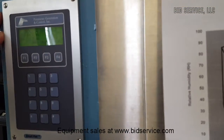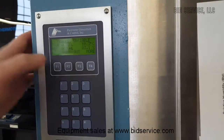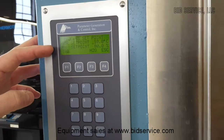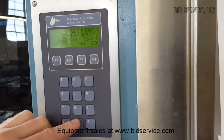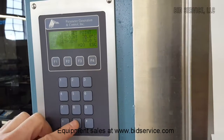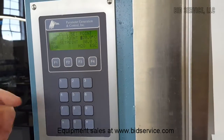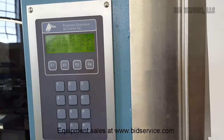Up here you have the process control. It's basically a single set point for both temp and humidity. You go in here, you have your air temp and your RH that you want. To make a change, you just make sure you go all the way through and that enters it. So now if I go back to set point, you'll see that 20 is the new set point.